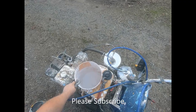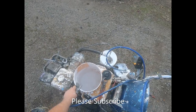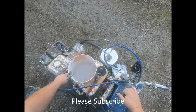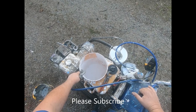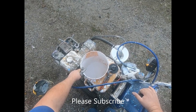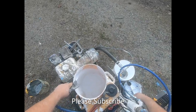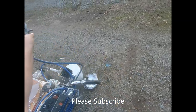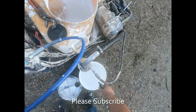This is the long hose, so this one's going to take a little while to pump out. Since it's pumping slower, you can turn down your pressure to half. Clip on, pressurize the system, but keep your hand on the trigger at all times. Flush out all the paint out of the system. Now we got water — you can tell the consistency difference. Water's through; turn, dump the primer back off, come over here, and now we're going to circulate the hoses back into the plain water.